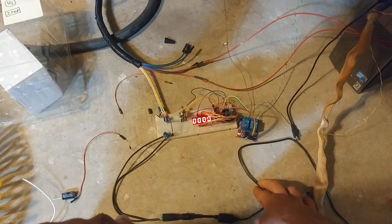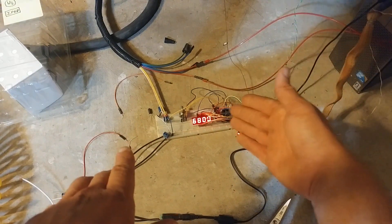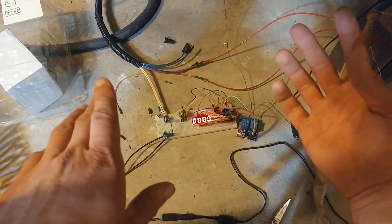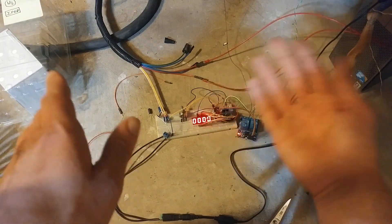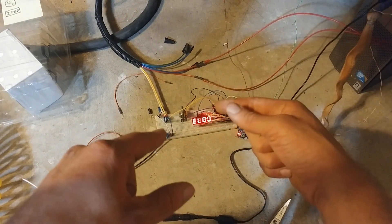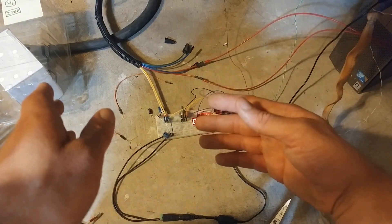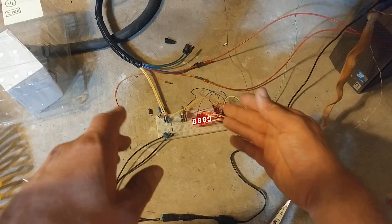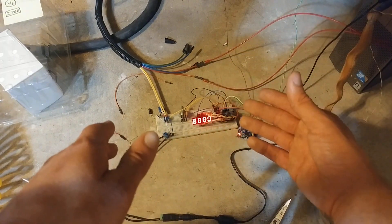Maybe having a longer wire on the 12-volt supply was causing it to pick up noise from the stepper drivers or the plasma machine being on. But with them off it's still doing it - the plasma machine is turned off and it's still reading values other than zero, the steppers are unplugged, still getting this noise. I thought maybe it was noise from the plasma and tried putting an RC circuit on there like a low-pass filter - that wasn't it either, still getting the noise. I also tried slowing down the analog-to-digital converter reading frequency, and tried turning down the LCD refresh rate. Same issue.